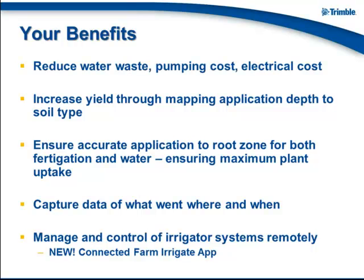Maybe you have one area of the field that's a little more sandy where water seeps right through, versus another area that's more dense. There's also the ability to report on what you have applied. If you use your irrigator to apply fertigation or effluent, you'll be able to see a report of where that material was applied, by how much, and when. Currently, there are numerous systems running in New Zealand, where nitrogen levels are regulated. If you can report on what you've applied and prove you're being a good operator, you can actually get better water allocation.